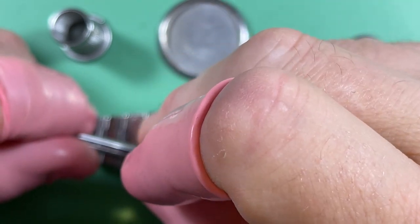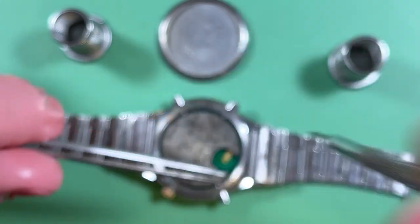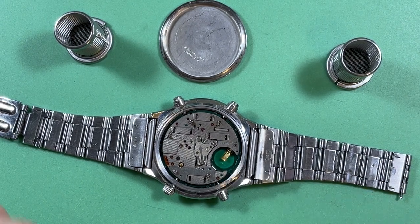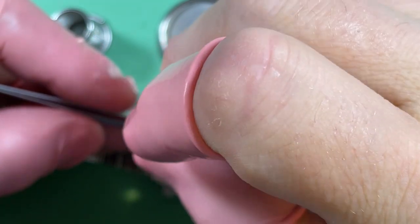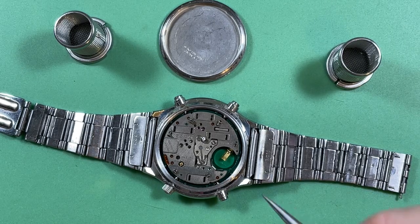Loose, and all of these things push down on connections because these things aren't bolted together. The connections touch each other because they're forced to by these screws, and if the screws are loose, then the connections are, wow, that one was really loose. The connections are intermittent, and then it's not going to perform.